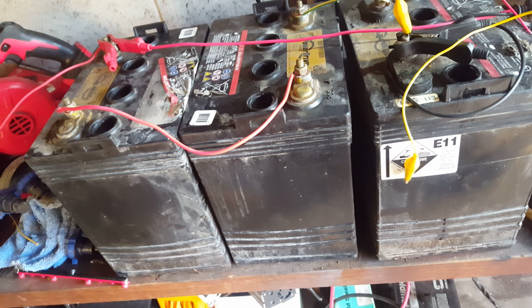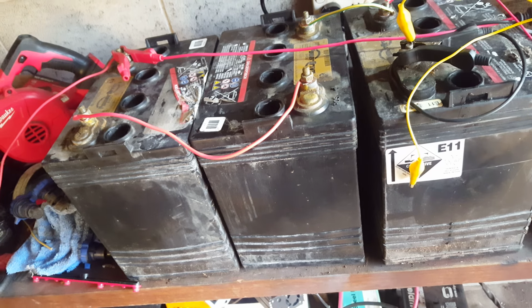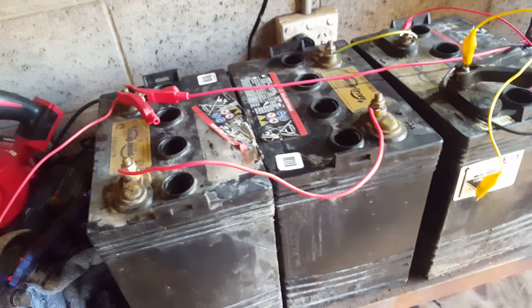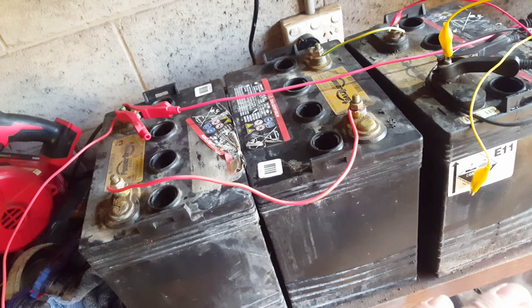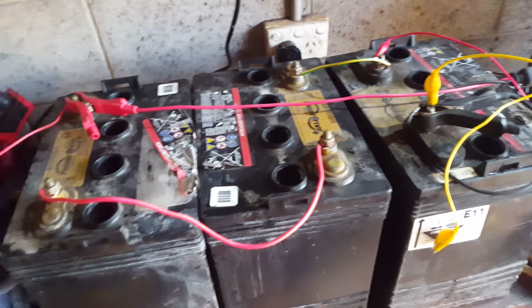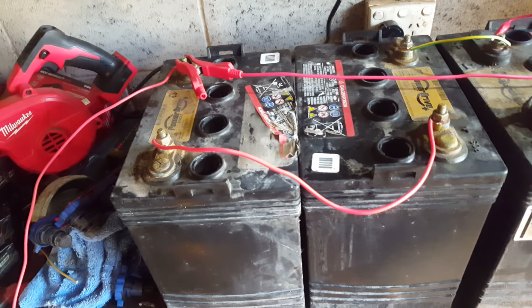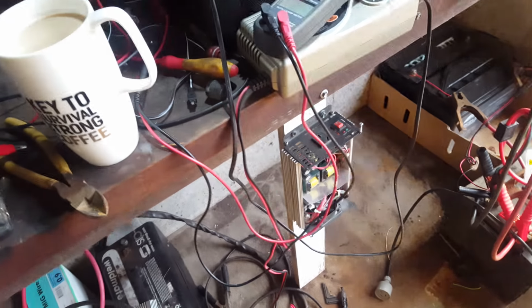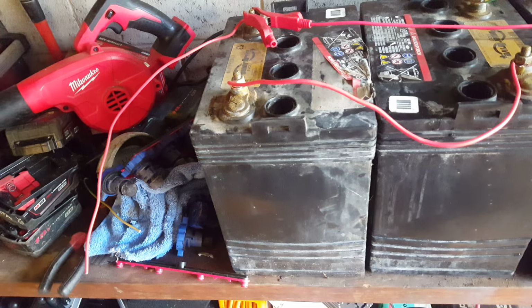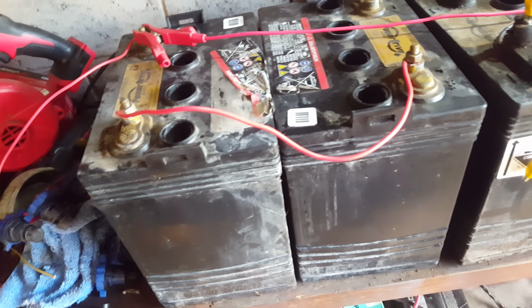I know there's things like the PIP. I think it's a 2424, which is a 10 amp 24 volt inverter, things like that, because even if these 3 batteries are shit, you can hear him bubbling. Which one was that? One of them. Even if they're no good, I will build a power wall out of 18650s, because I think 7 in series worth of 18650s works out better than 3 in series for your 12 volt inverters, because you're always on the low side of what the inverter can take in, and it just puts more load and more stress on things, obviously.